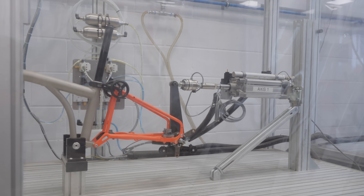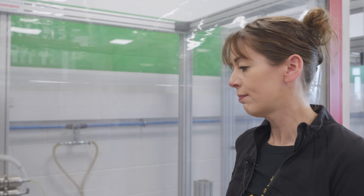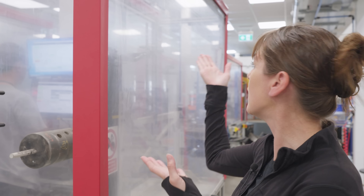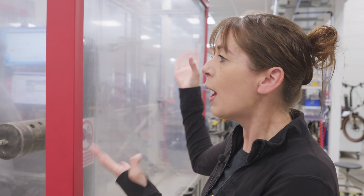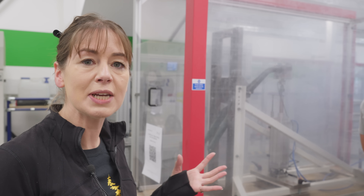I challenge you to brake that hard — I brake quite hard and I don't brake that hard. It's 500 newtons in the direction of braking and 50 newtons the other way — that's pretty harsh. This is an early type of fatigue tester specific to Brompton. Currently they're testing the C-Line electric forks, but it's what's been driving development and assessment of the G-Line forks. Brompton realized it was easier and quicker to have all their testing in-house rather than outsourcing to places based in Germany.